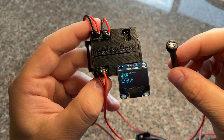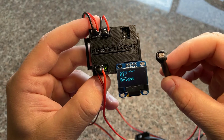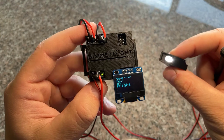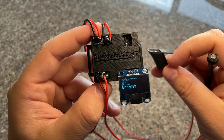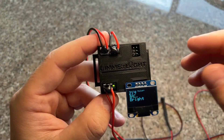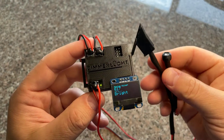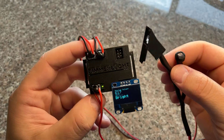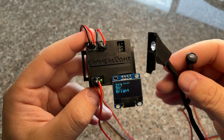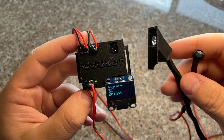This is actually the value the photo sensor is seeing — you can see it jumped up because it's under this light, so it reads 'very bright,' which then triggers the LED to be on or off. That's how the box works. There's a bunch of engineering behind this board and the code — fairly simple yet complicated — and all these different parts were made to make it look and function well. I just wanted to walk through this to explain what we have going on and why I did things the way I did.